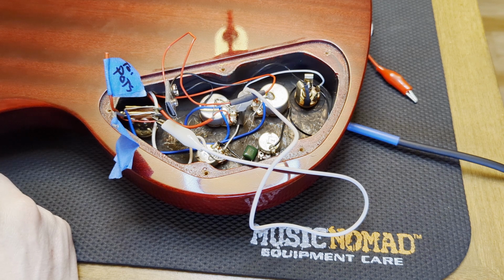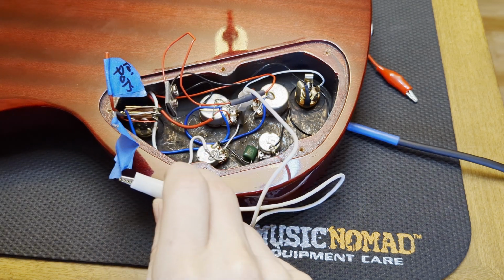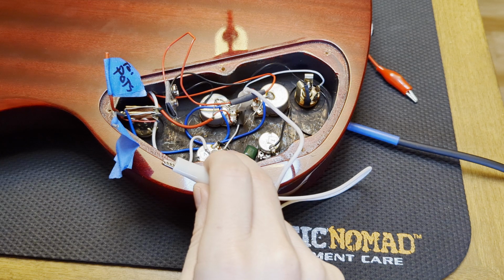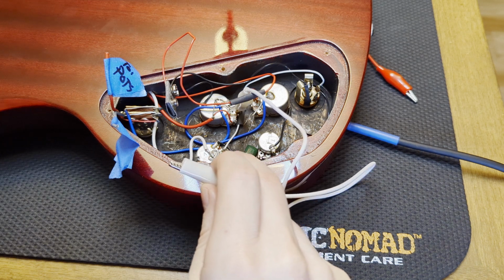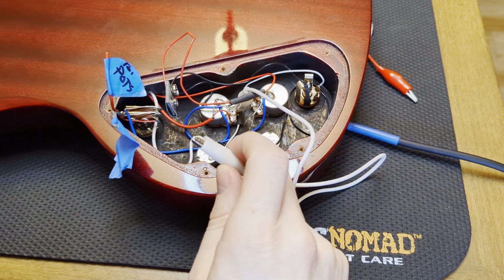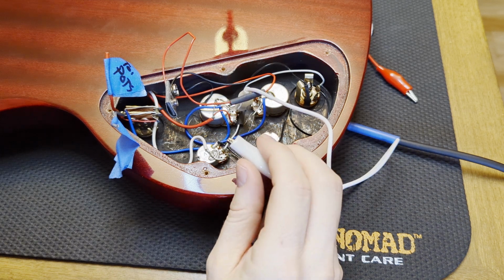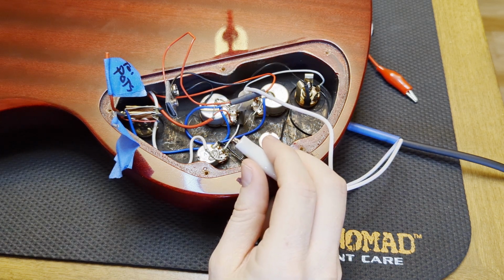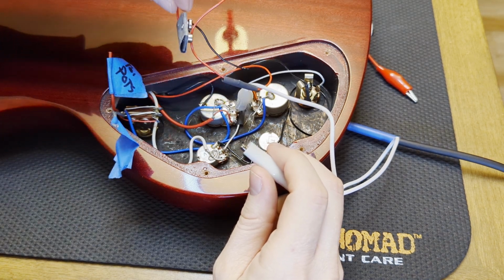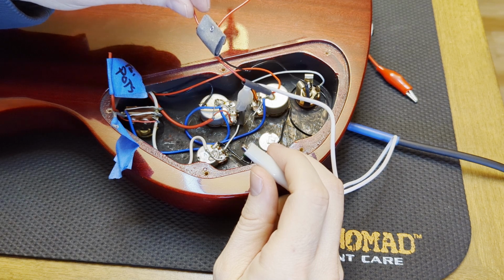Yeah, so none of that's working. The switch is not really doing anything. For the most part, I think the switch is basically bypassed directly from the active pickup, so it looks like it was actually wired to only run the one pickup. It may not have ever been finished firing up that second one, so that's what we're gonna do.